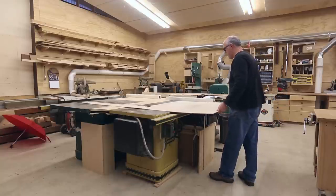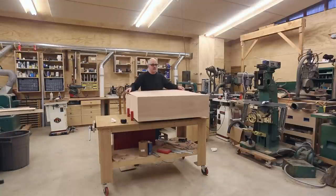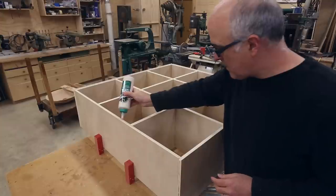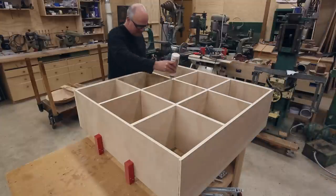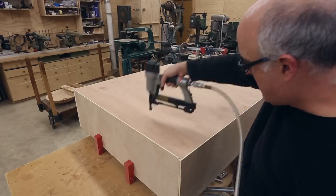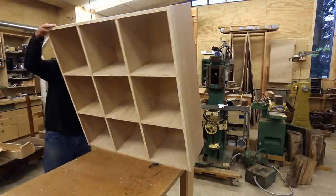This is the back being made, which is just a piece of plywood. This back piece should be very close to square, so it'll help hold everything at right angles as well. If I'm going to nail this into the shelves, I need to mark where the shelves are, so I draw lines to know where to put my nails. Now I'm gluing everything — I find it's best to glue further away from you and then glue towards you, because you'll get glue on your arm and sleeve otherwise. I think I'm actually using staples here, which works pretty well. And the main carcass is finished.